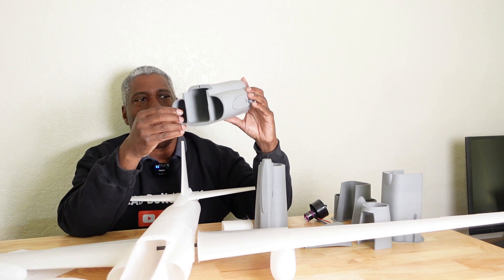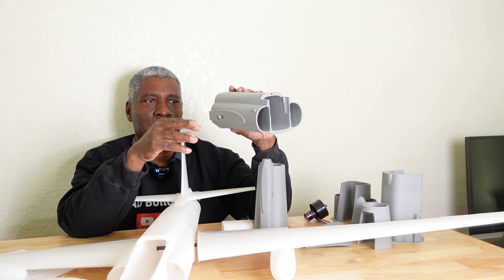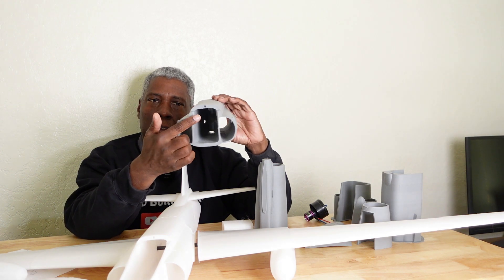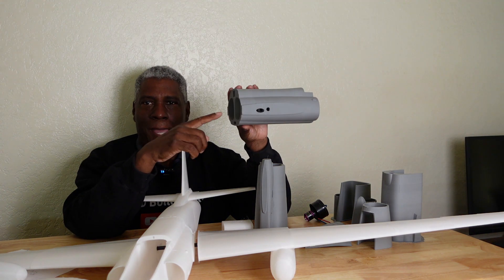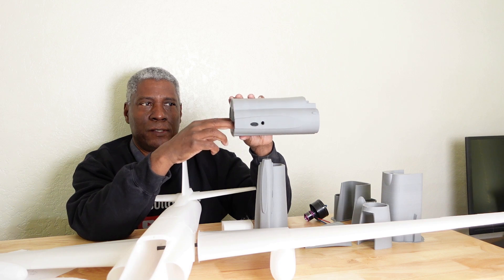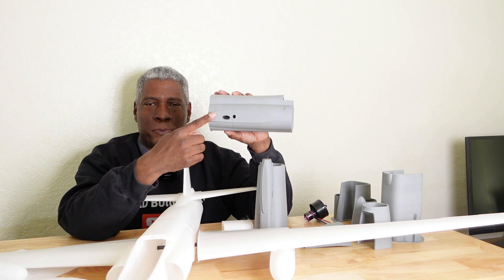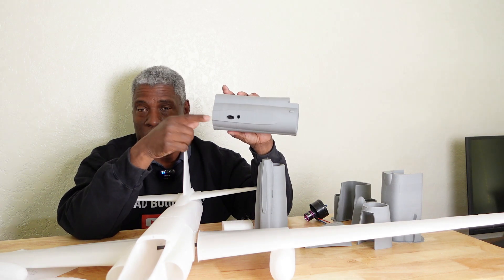This is a large section here. How I would do this - once again while this is all solid - I would sketch on the front plane here and sketch this shape. Then on the back I would do the same thing, and use a loft cut to cut through here and do both sides like that to give you that opening. Then for the sides here, you just sketch on this plane and draw or sketch these, then extrude those out through the side.